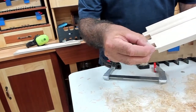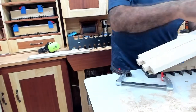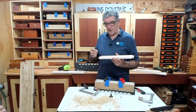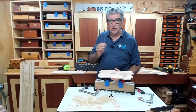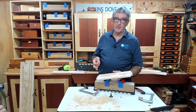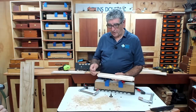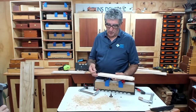that it's been missing. Okay, so you just need to be a little bit aware of that, particularly with some timbers. You'll find, camphor being a very light timber, that occasionally you will get a little chip out. Silky oak does it occasionally, not very often, but it will do it. Cedar does it occasionally because, again, another light timber with very fine fibres. So you'll get a couple of those little problems depending on how wide your piece of timber is. Now, if the timber was a little bit narrower, it probably wouldn't have happened, but it was right at the